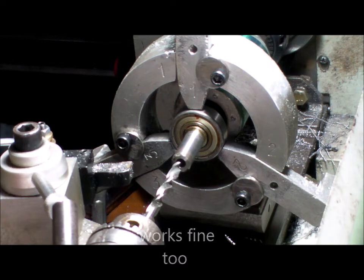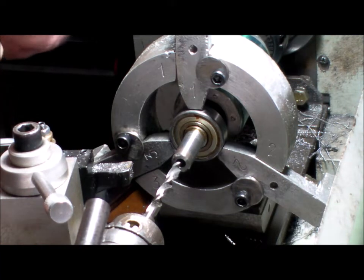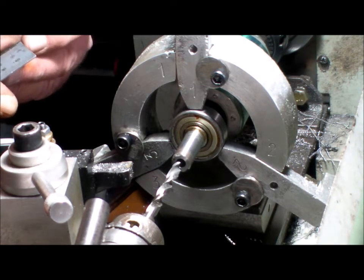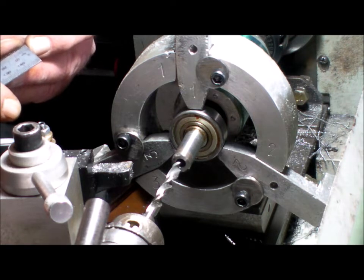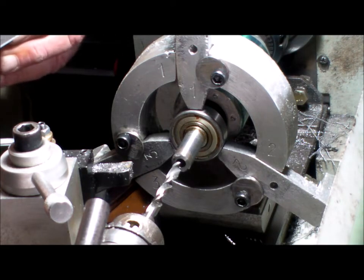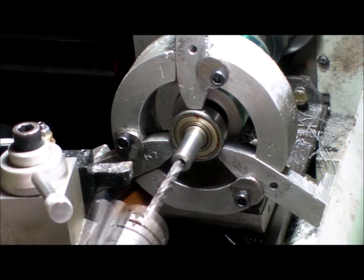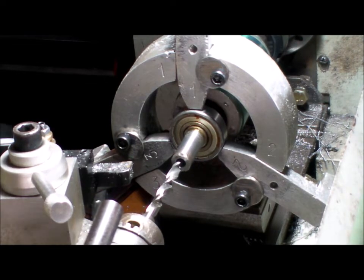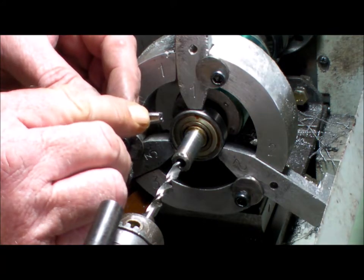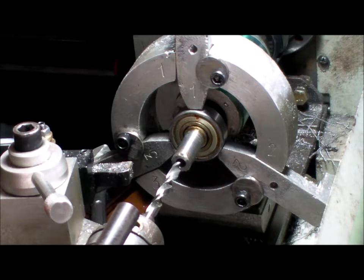Okay, that was 15 mil deep. I should be able to get 13 mil, 12 mil. Take 4 off, that's 11 mil of engagement. Might just go a little bit deeper. Alright, that's 18mm deep, that's plenty deep enough. Take, say, three off that, because we're not going to get threaded on the last 3-4mm. We'll take 5 off 18, that's 13mm engagement, that's plenty. It's a 7mm bolt.